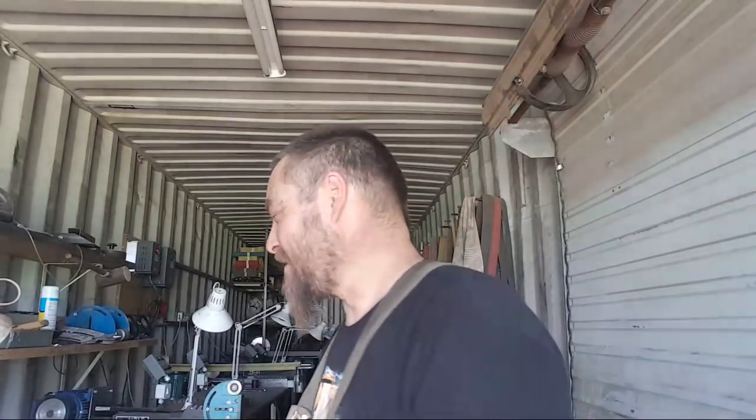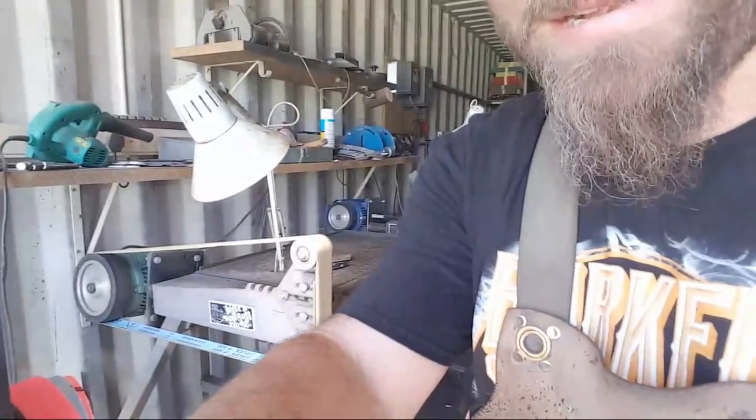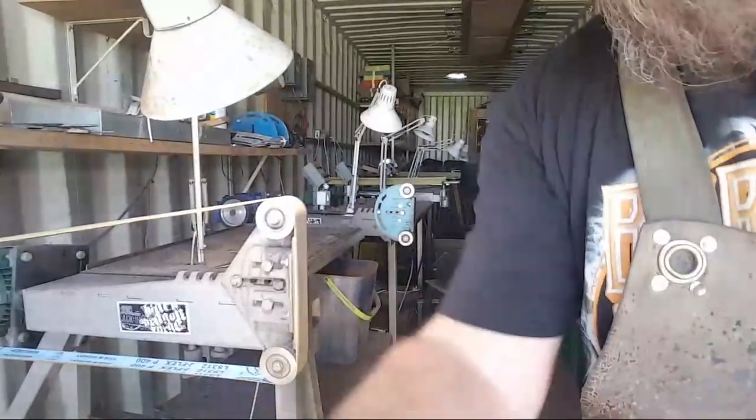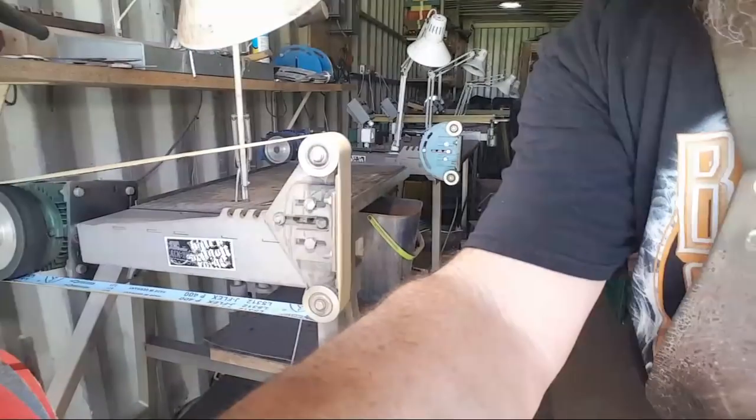So standard as you've been grinding, just add a slight angle and do a bevel. Yeah? Not rocket science. Turn it around, same bevel on the other side. Keep it consistent. Keep in mind it's an old 400. You want to turn your speed down as you don't want to burn your cutting edge. Most important thing. Alright, so let's get to it. It's as easy as that. Enough talking. Let's just do it.